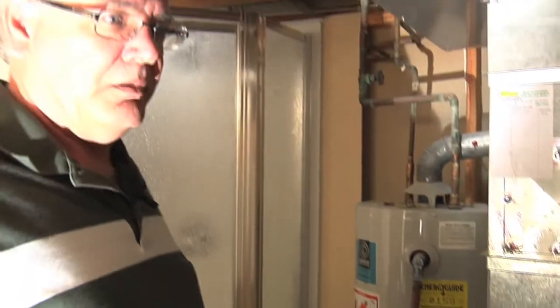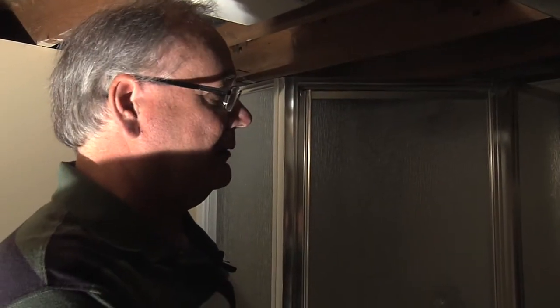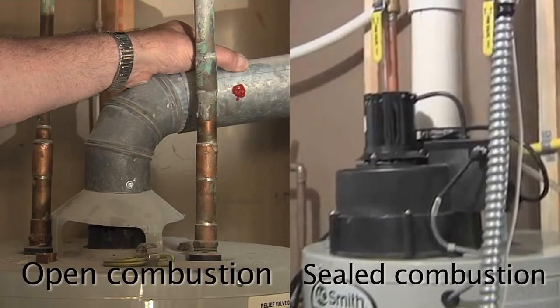The other problem with the water heater is that this is a combination bathroom utility room. We've got an exhaust fan here and a dryer behind you, and with those two running and the door shut, there's no way this water heater is ever going to vent properly. You'll probably have to change out the water heater — these kinds of systems just do not work. This is a serious safety problem: we can get carbon monoxide spilling out of the water heater, and if somebody's in here taking a shower, it could be a real problem.